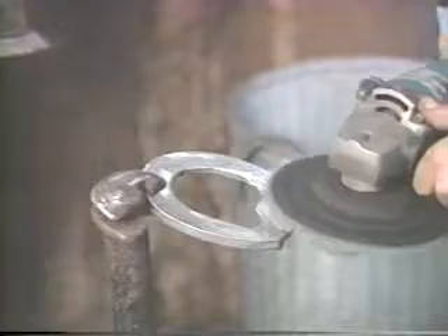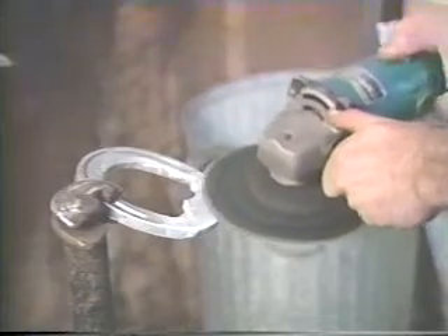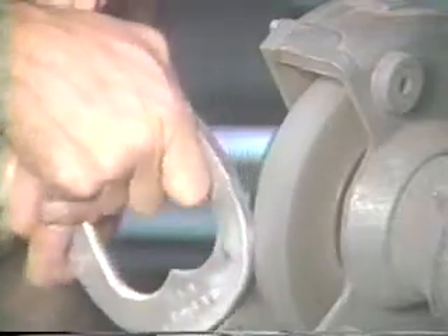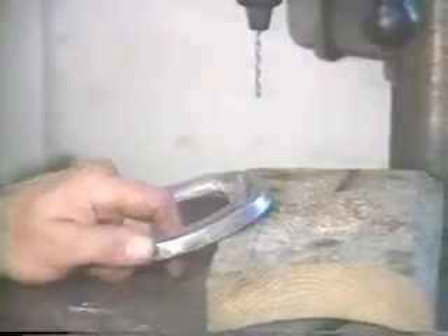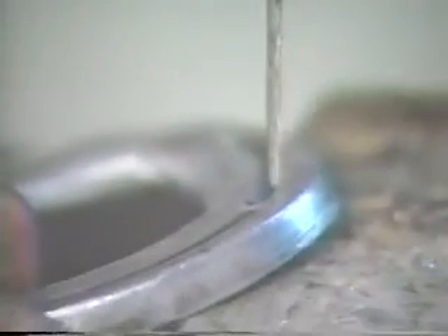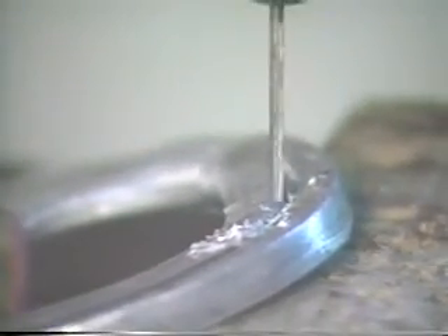The advantage of welding with a torch allows some flexibility of your bar. Once you've welded and cooled, now you dress it down. I grind out most of my weld — I want to dress it so I can't see my weld joint. I cut the front leading edge; I want all my bars to have a nice cutting edge on the front so they don't form a drag. Then I polish it. By polishing the ground surface of the bar, you actually surface-harden it to the point that you restrict the amount of wear and friction. Those bars that are surface-hardened in this fashion can be reset up to three times on a racehorse. If you do not polish the bar, the aluminum will often wear very quickly and you get only one reset.